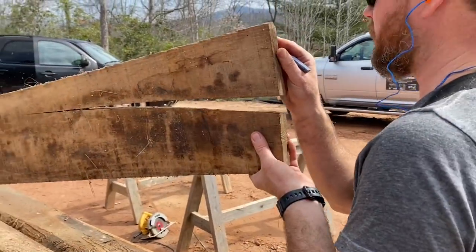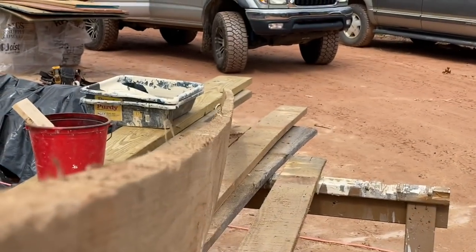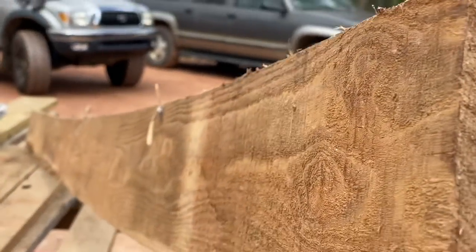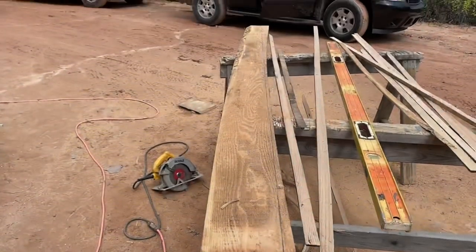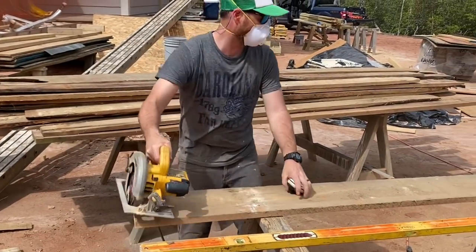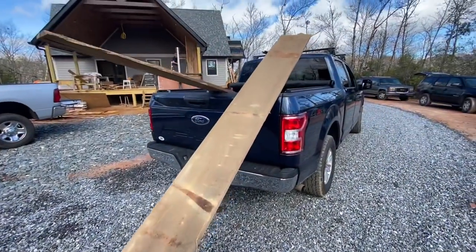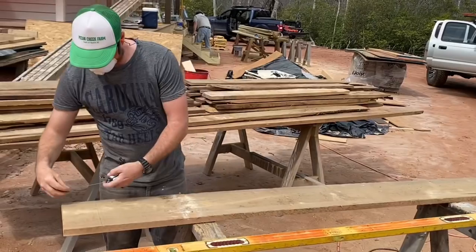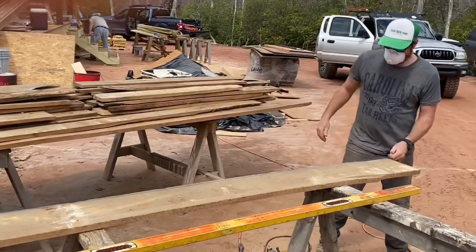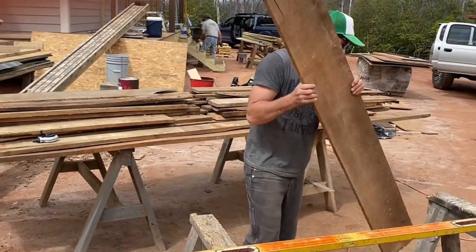Other boards had inches of crown, and on those I tried not to cut off more material than necessary. Some boards looked more like a rocking chair leg than a piece of building material, but I tried to use everything we picked up. If you're thinking about doing a project like this, get more material than you think you need — full disclosure, I had to make a second trip because there was so much waste. For boards longer than my six-foot level I snapped a chalk line, though it wasn't always visible on rough wood, so I traced it with a pencil before straight-edge ripping.